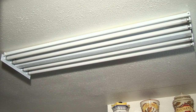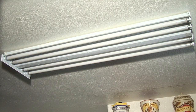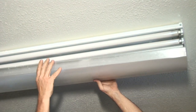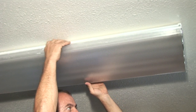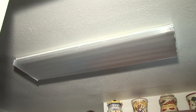Now that we've got the lamps in, our next step is to turn the power back on and test the light. As you can see, it works fine. Turn them off and put the lens cover on. You can see it's U-shaped. I like to put one side on first and use it as like a hinge — push it up, slide it back over a little bit, and it rests back down on the ledge of the fixture itself.